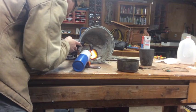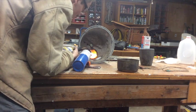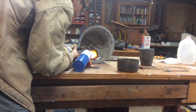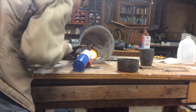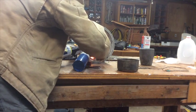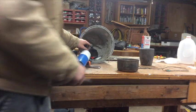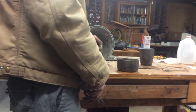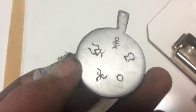To be honest, what I'm doing right now was kind of a big mistake. I was trying to temper the steel, and that worked. I used a little bit of borax to flux the steel, and I'm not sure if this had anything to do with it, but when I was done there was an impenetrable hard coating on the surface. It looked like some sort of mixture of borax and iron oxide. This coating was much harder than the steel itself, and it took me hours to get it all off. After I had cleaned the surface of the amulet very well, a small amount of this coating remained in the grooves of the characters, giving them a very bold appearance. It's looking good.